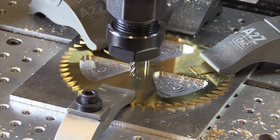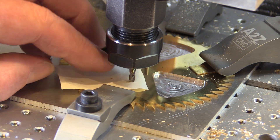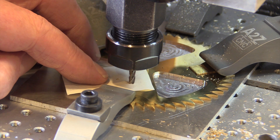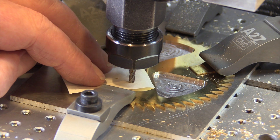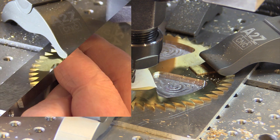When the controller is finished using the 3/8-inch end mill, it pauses and asks me to switch over to a 1/8-inch end mill. Once again I have to find where Z zero is — where the end mill touches the top of the gear. Again I zero the controller and then I hit the continue button.